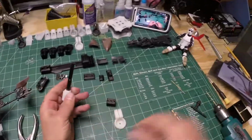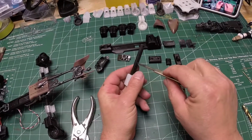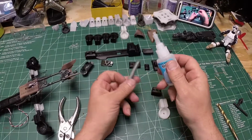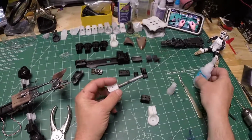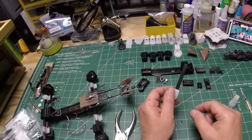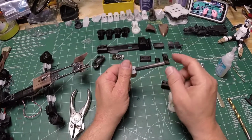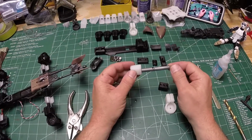now after you drill the hole, or after you cut carbon, you can clean it up a little, very lightly. I'm barely using any pressure at all to clean this up. And then take some thin viscosity CA and dab the holes. And you can hit it with a little bit of accelerator if you want. Then once that's done, then you can shape the holes up a little further if you want. I don't think you should really touch it too much, and that'll keep it from splintering.